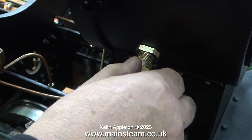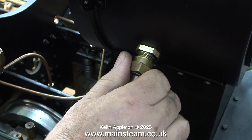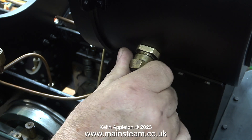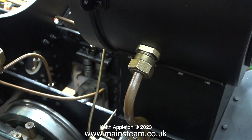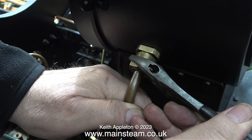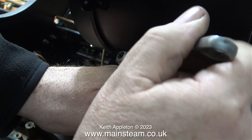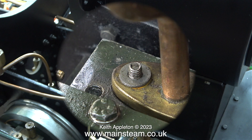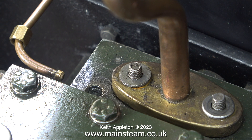This is what the brass union looks like when it's bolted in place on this side. When I fitted the steam pipe flange onto the mounting studs, the pipe fitted into the union perfectly. This wasn't the case on the other side - this was one of the few fittings that would tighten by hand. I finished off the tightening using a spanner, but I did not over-tighten it. Working on small steam engines is very different to working on car and van engines - there is no need for torque wrenches; it's an entirely different principle, largely based on feel.